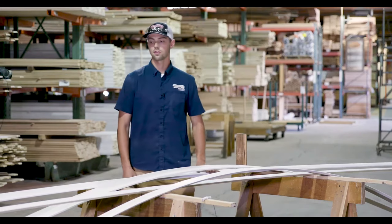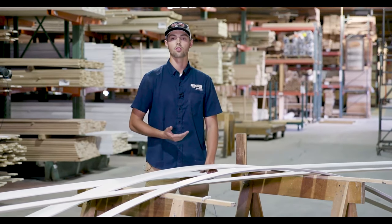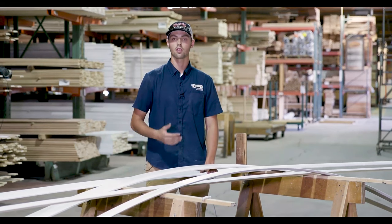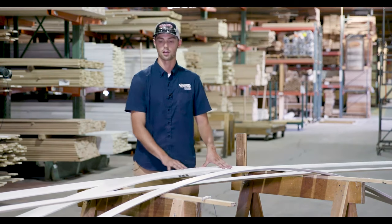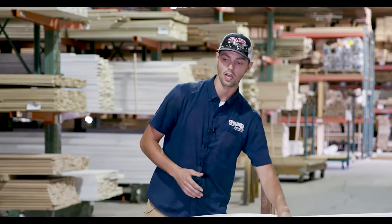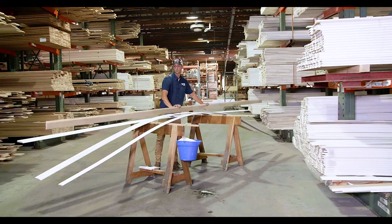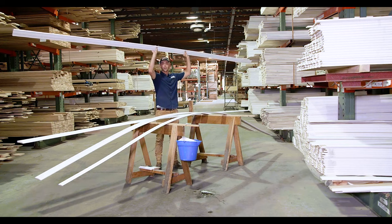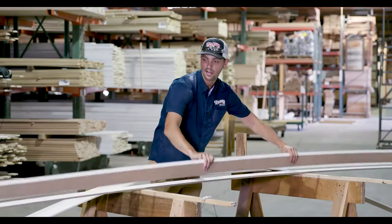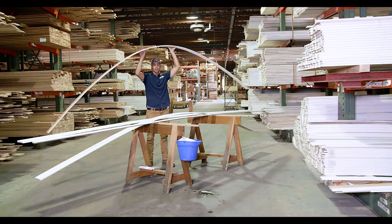On price point, they say on average it costs about $600 more to trim out a 2,000 square foot house using finger-jointed material compared to MDF. But if I'm hanging crown on my own, this finger-jointed piece is easy to hold over my head. If I'm by myself and try to hang the MDF piece, I'm going to have a heck of a time doing that on my own. Our finger-joint material is definitely worth the money.